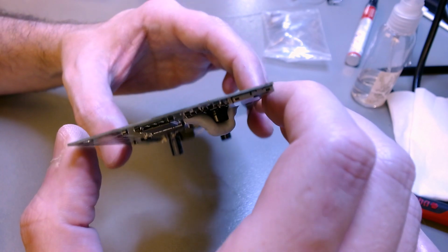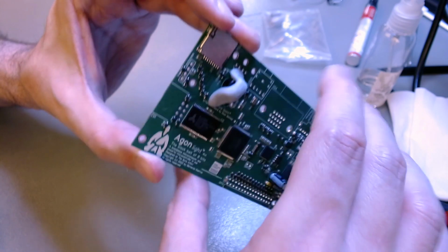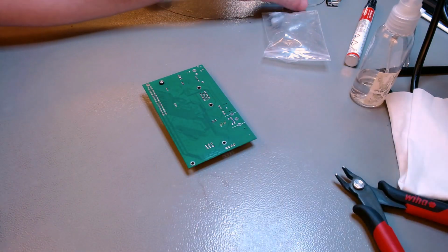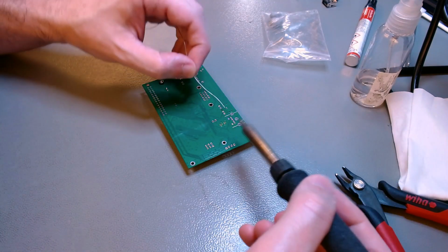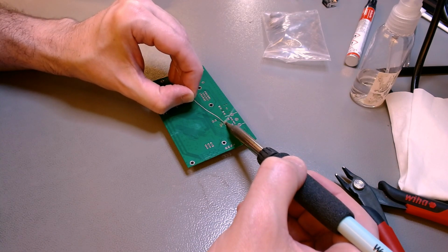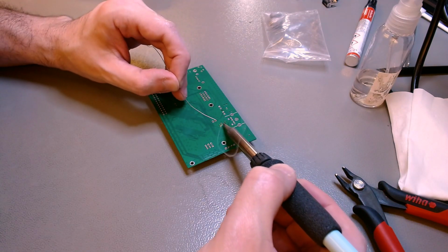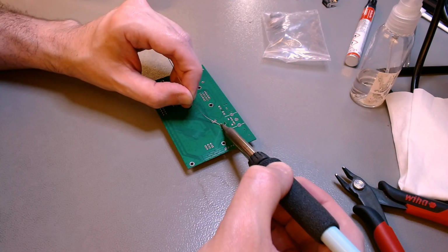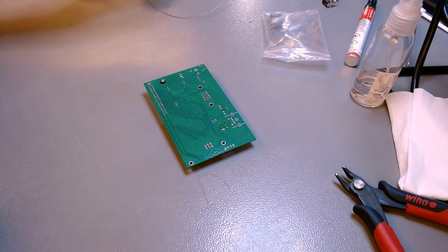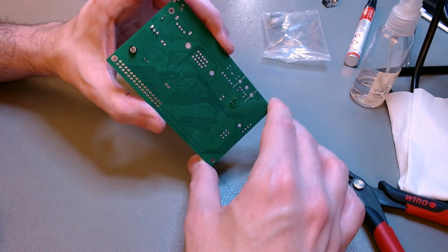So what you see me show you now is the solder paste. The blue tack is making sure that the buzzer is in position. So now we just flip it around, turn on the solder fumes extractor because I'm using leaded solder. I don't want to breathe that in. I want to leave long. And I solder it in place. I have not only the solder fumes extractor on, I also have a ventilator pointing to a window and pushing the air out of the room.